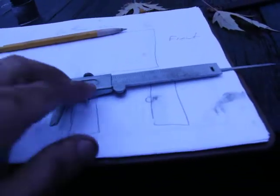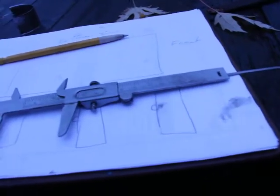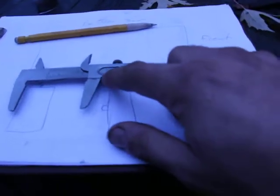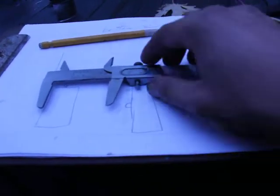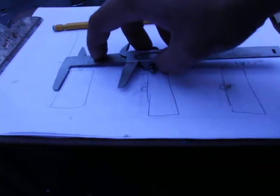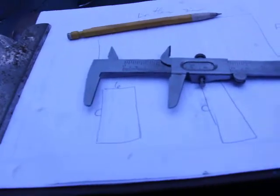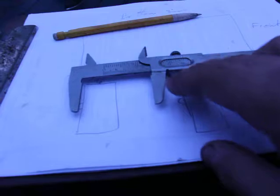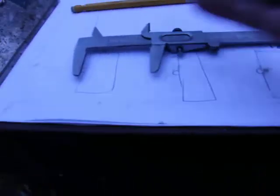But like I said, most scales. But in all of the vernier calipers, I searched on the internet and couldn't find a simple result anywhere. But I was able to figure it out: on all of the vernier scales, independent of how many divisions there are, the entire vernier scale represents the smallest division on the main scale, right? So in this main scale, the smallest division is 1 millimeter for the metric system, and 1/16 on the imperial, right? So this entire scale here represents 1/16, and the entire scale on the vernier, in this case, represents 1 millimeter.